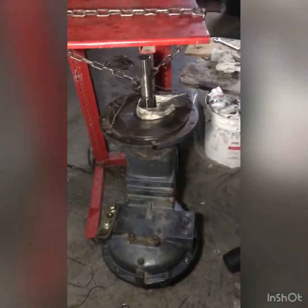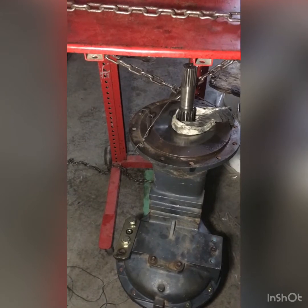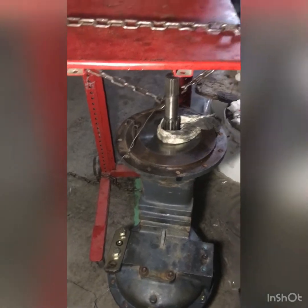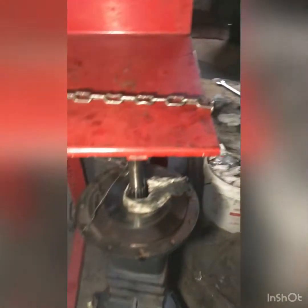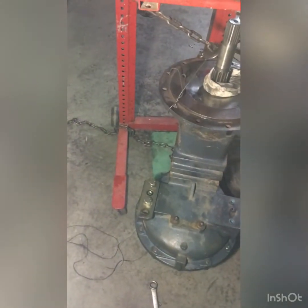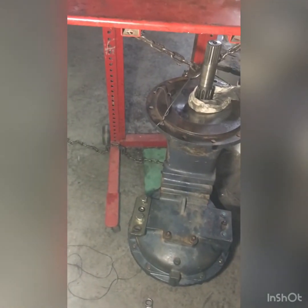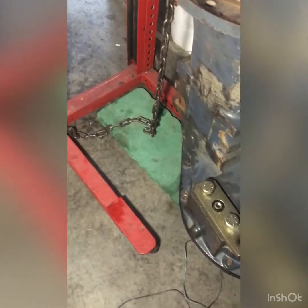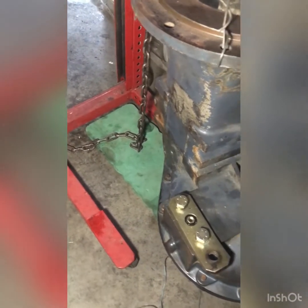You have to be careful when the shaft tends to slip out of its chamber, so it's very important you remember the shaft is actually sitting inside of the fender. But we managed to use a rope downward at the bottom of that, holding the big bearing and the gear, because otherwise the shaft will fall down. And as you can see, we used a mattress to protect the shaft if it falls on the concrete floor.